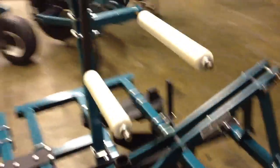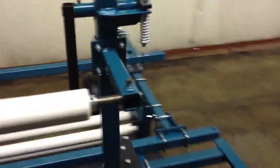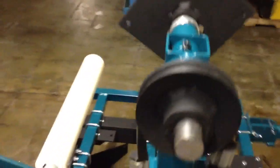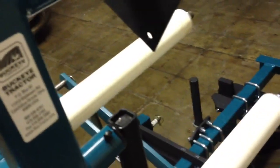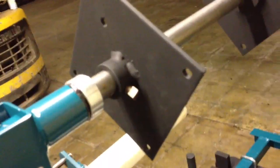On the back side here you've got plastic mulch that sits on here — you take it around and underneath the big one and it comes out the back. Up here is for your drip tape, and this has a brake on it as does the mulch. You put your roll of drip tape here, take it around this one this way, come back around this one, and then take the drip tape down that tube. You can't turn this thing, but when you push this roller back — which is what the drip tape will do as you pull it — it'll pull that back. It's spring-loaded, and that releases it, so this will spin.